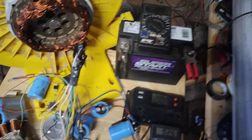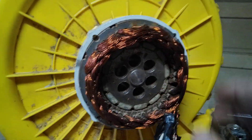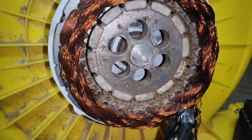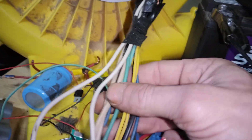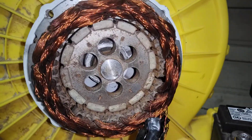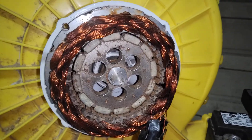This is the same identical motor as what we just saw. There are three different sets of coils and they're all overlapped. I undid the wires because it was three phase with a center tap — I've isolated every set of coils on the motor. That gave me six coils to collect from. I currently have them all wound in series.